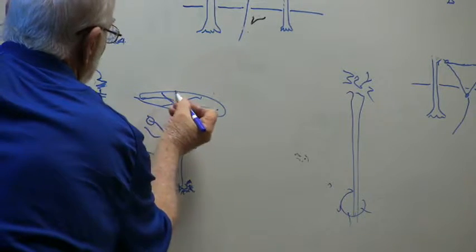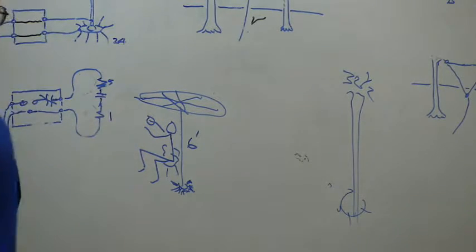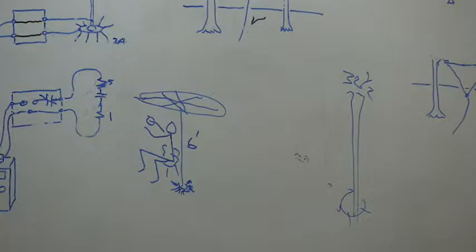It was a top-loaded vertical. He made that about 5 ohms. You cancel this out, and you've got something that's as effective as the big one at 32 1/2 feet. He found no difference in it. His wife was simply for scaling, so you could look at it and see what it looked like, size-wise.